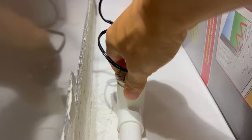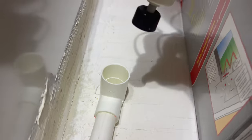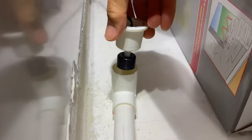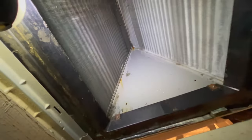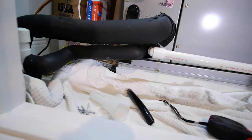On this side over here I've got the safety switch for the condensate. What happens is if your condensate pan gets clogged up and doesn't drain, it'll actually fill up the secondary hose and then trigger the float switch in there to stop the unit. On these vertically mounted units, the condensate pan is actually a little tube that goes around the unit and then it drains out to here. There's not much surface area for it to collect condensate and it has to drain properly all the way.